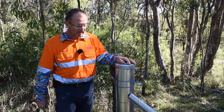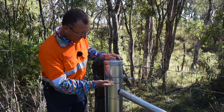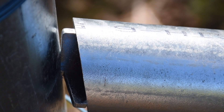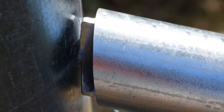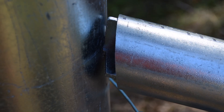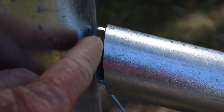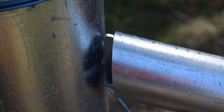I've had a few questions about the fact that this is a quite small contact point — will it fail? Is there enough surface area to hold the pressure of the stay? If you come in and have a close look, the 13mm hole we drill there is actually just a locating point. The four-way stay point actually bears up onto the post, and the same happens on a timber post. So the more pressure that comes onto it, the more bearing surface there is. These four lugs around it have little steps that sit onto the pipe, so you've really got to push through like 20mm of pipe before that will fail.